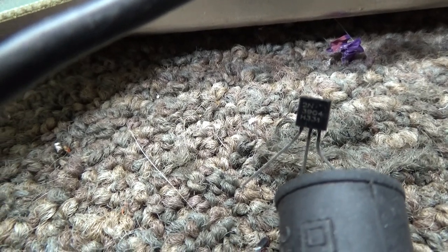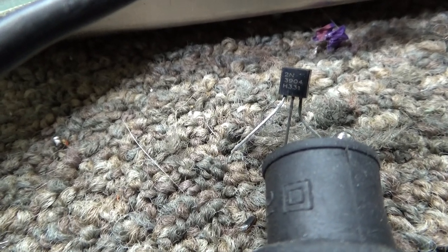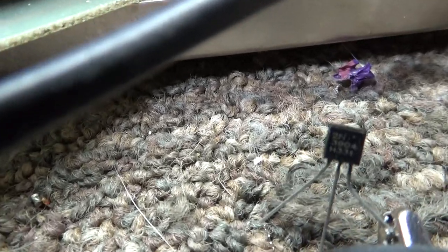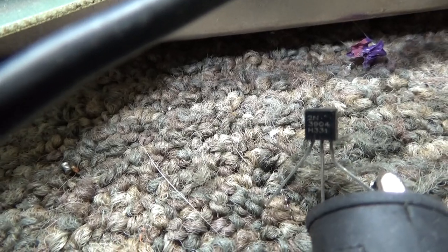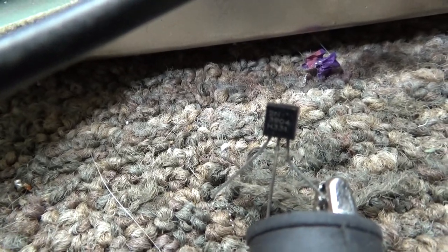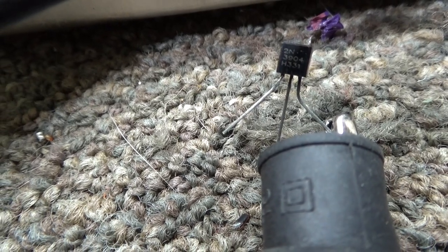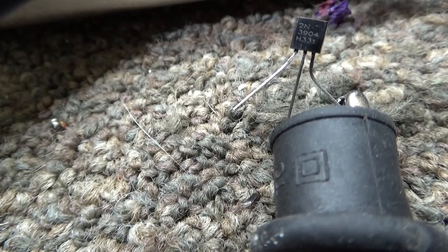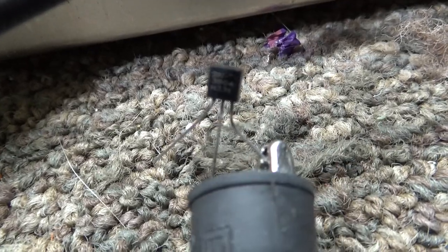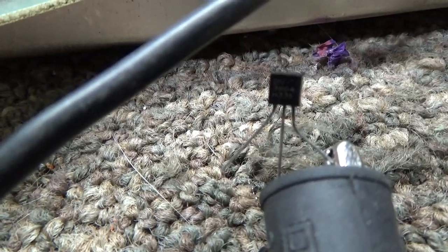And it doesn't matter which transistor you're using. Just about all the keying transistors in sweep tube type linear amplifiers use something similar to this. You know, 2N3904, some of them have metal cans, the 2N2905s. Doesn't matter. You're still looking for two diodes, and the rest of it should read open. If the rest of them aren't reading open, it's got leakage in it, and if you find a short, it's done. So that's a quick and easy cheat test to test common switching transistors like that.